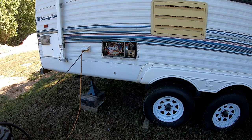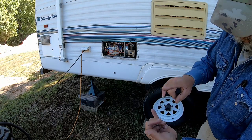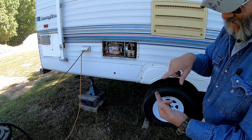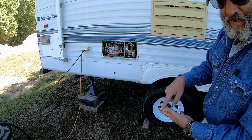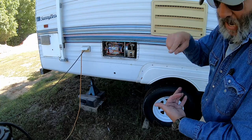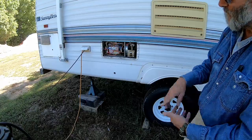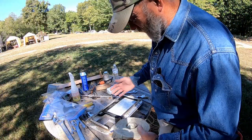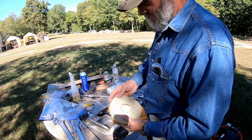So there you go. It was a combination of dirt daubers, stuff just being dirty, the high temp switch bad, the thermostat needed to be repaired slash rebuilt, and the propane regulator was bad. So now it works. Since we now have a functional furnace, the next step is to finish putting everything back together.